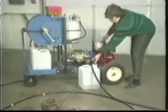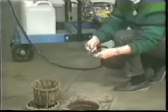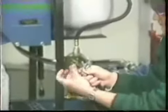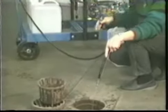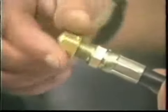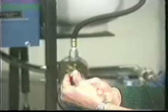With the 2200 series, priming can be done after the jetter tip is in place on the outlet hose. However, any debris in the system may lodge in the jetter head, so it is always best to flush the hose first. Whether you have the 10E, 12E, or the 2200 series, place the penetrating jetter head on the end of the jetter hose to hand tight, then one quarter turn with a wrench. Do not over tighten — this could block the flow of water to the jets.